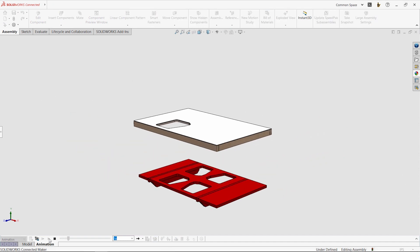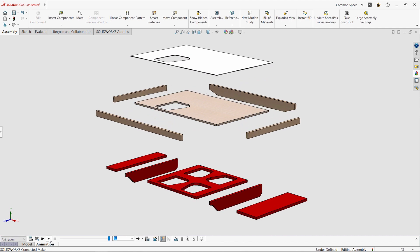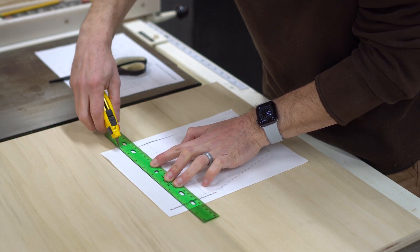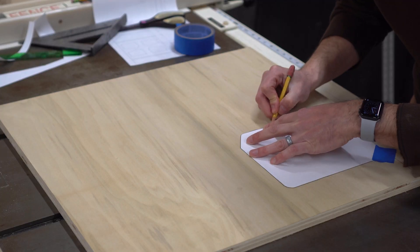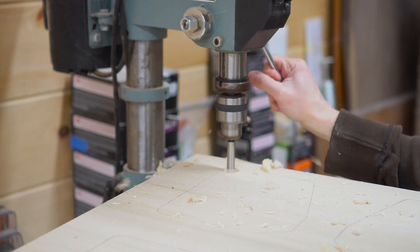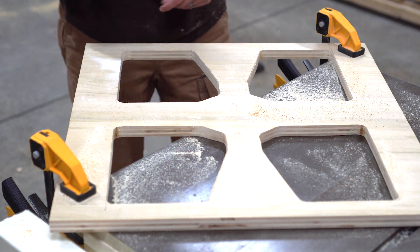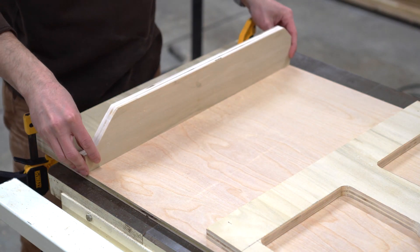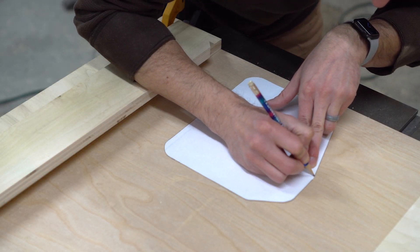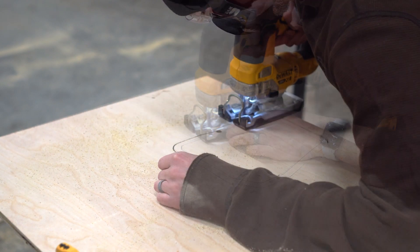Now let's take a look at the tabletop. It's built up of two layers of plywood, a top layer of coated hardboard, and maple edge trim. The construction is fairly straightforward, but there are a few critical things to consider. The first is the opening that allows clearance for the motor. I printed out one-to-one scale paper templates, cut them out, and then used them to locate the opening. On the thicker piece of plywood, I made four symmetrical cutouts just to reduce the weight a little bit. I simply drill a pilot hole at the drill press and then take my time using my jigsaw to cut out the openings. I can then start to clamp the pieces in place to help me locate the corresponding opening in the top layer of plywood. I'm using another, larger, paper template to lay out the shape. This will create a ledge upon which the insert will rest. Drilling a pilot hole and using the jigsaw completes this step.